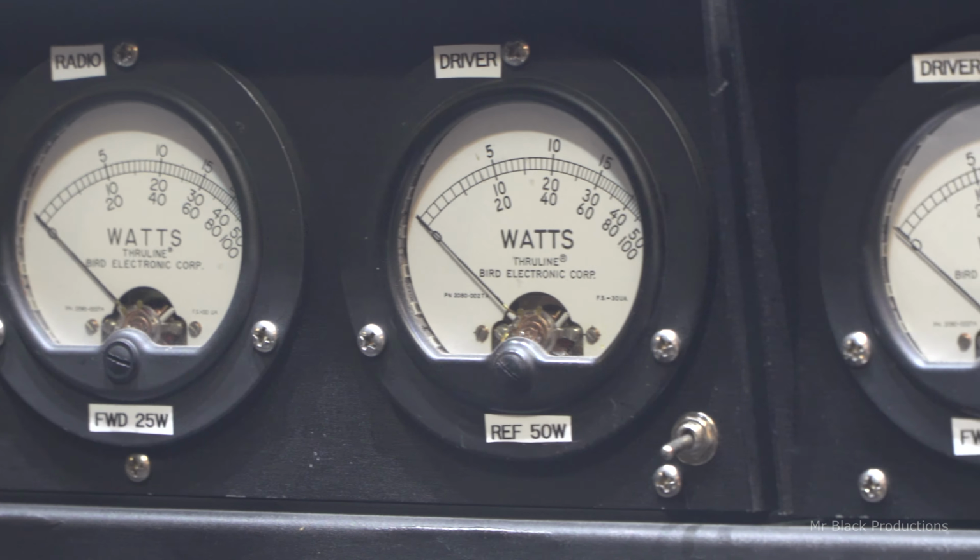But the other thing I wanted to talk to you about is, do we really want to stay with the lead acid batteries that you have in this truck, or do we want to be progressively thinking about maybe doing lithium phosphate or lithium ion or some of the other lithium batteries where the resting voltage is at 14? Yeah, we might. It's a little bit of money, but it's a whole lot less maintenance. They're sealed. They have a much higher duty cycle. They can inrush current almost as fast as the supercapacitors, but I can't seem to find anybody who wants to jump onto that bandwagon with me at all.